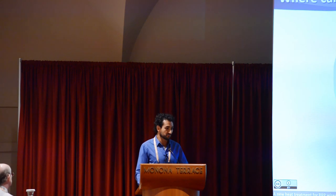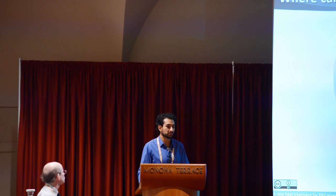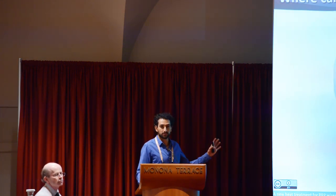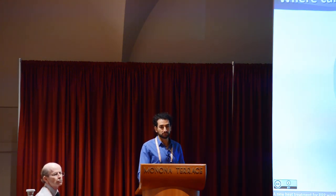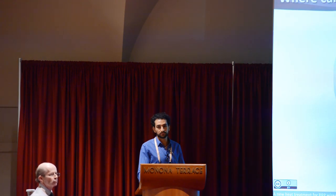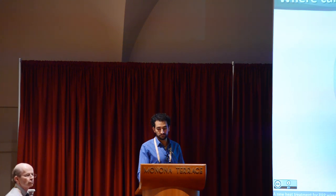I've damaged a few sub-elements to see whether it forms or not, and it does form, and I wouldn't be surprised that the copper also diffuses in. I would be more concerned as far as deformed wires about the triple R, but I think JCs are pretty achievable even in deformed sub-elements. But you know that when we use Rutherford cables in these highly deformed wires, a high risk is tin leaks.